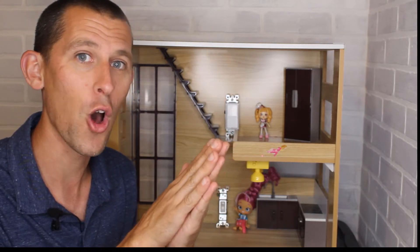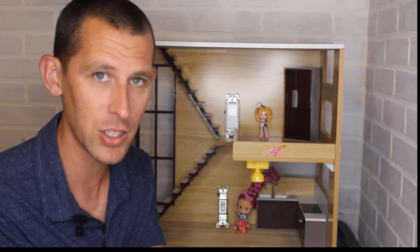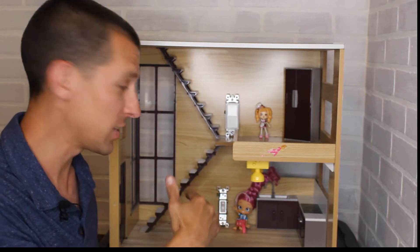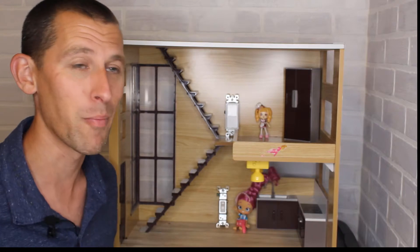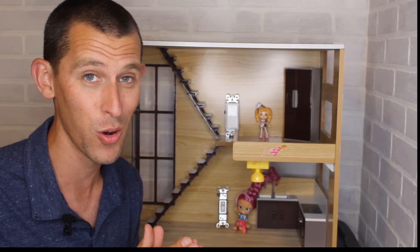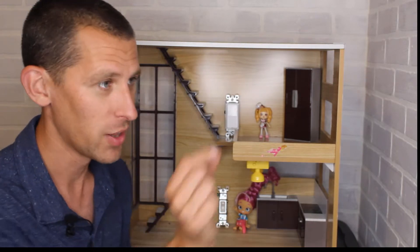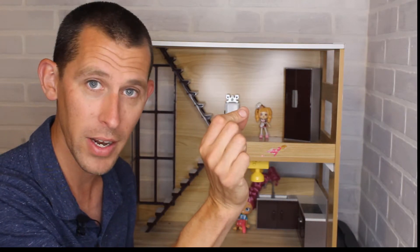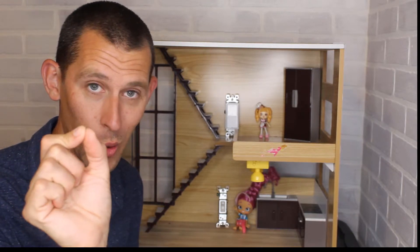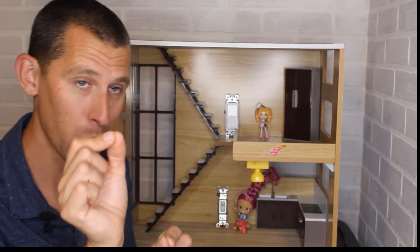The trick here is not to use an auto changeover thermostat. An auto changeover thermostat switches from heating to cooling on its own, and that could be a problem — one thermostat could turn on your air conditioning while the other turns on your heating, and your system may go into a limp or fault mode, or potentially short something out. So no auto changeovers. There should be a button or dial that says heat, off, cool. You want both thermostats set to the same mode — both in cool, both in heat, or both off.